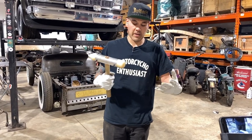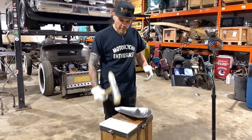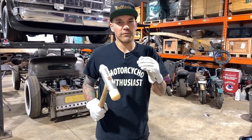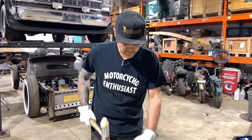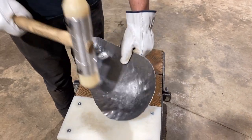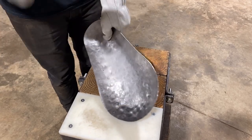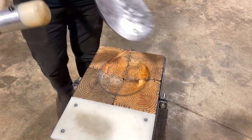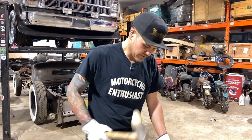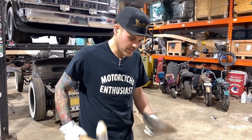The other beautiful thing I'm noticing about the nylon is there's a little bit of bounce — recoil to it. I'm pretty much just dropping the hammer and it's bouncing back up, so it's not taking that much force for me to planish this out nylon on nylon. You'll notice that if the metal springs around and moves, I'm not getting that bounce back. But if I'm hitting it on an edge, it really doesn't take much force for it to pop back up. My arm's a little sore from using the stump bowl side, so I'm going to keep on keeping on.